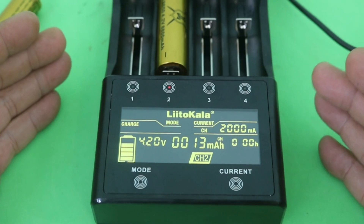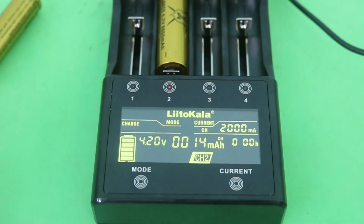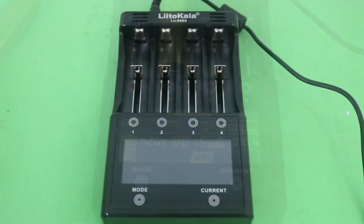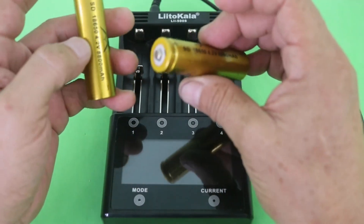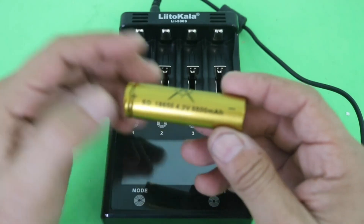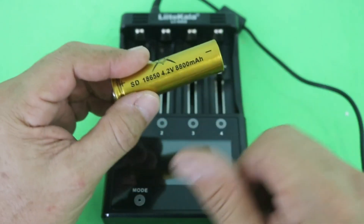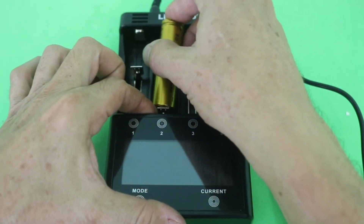After the battery is completely charged, the charge process will stop, and you will read the total mAh that has been put into your battery and the elapsed time. I will try with these two batteries in the test mode in order to obtain the capacity of the cells. As you can see, this battery says 8800 mAh, which of course is not true — even the best batteries will give you not even half of this capacity. But let's check to see what capacity we actually get.